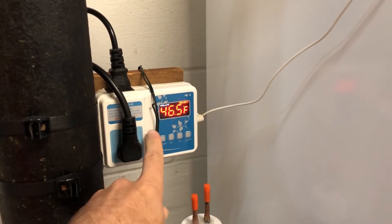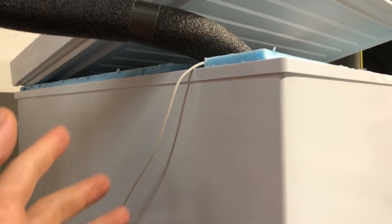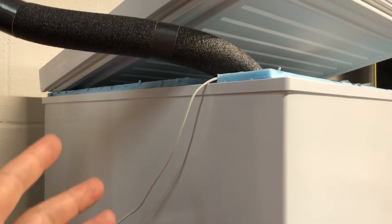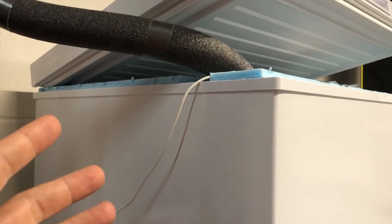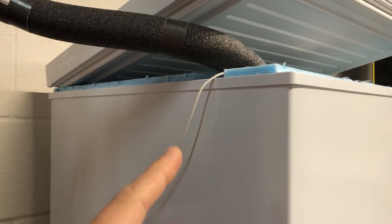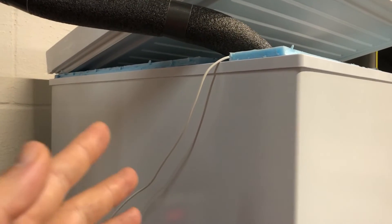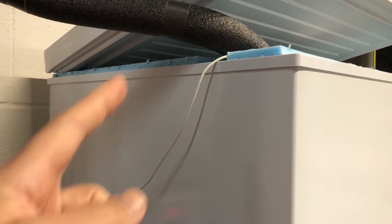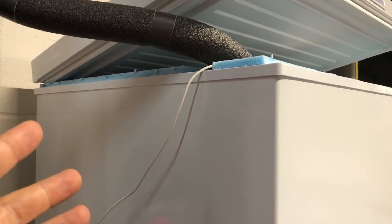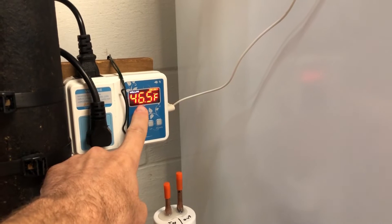The whole purpose of the thermostatic switch is so the water in the chest freezer never freezes. You could add something like alcohol to prevent freezing, but I don't recommend that. Water is one of the best liquids on the planet for transferring thermal energy — it does it quickly. If you put antifreeze in and pump it through the heat exchanger upstairs, it's not going to output quite as cold air because it won't transfer heat energy into the fluid as quickly as it moves through. Water is the best thing to use — keep it simple.